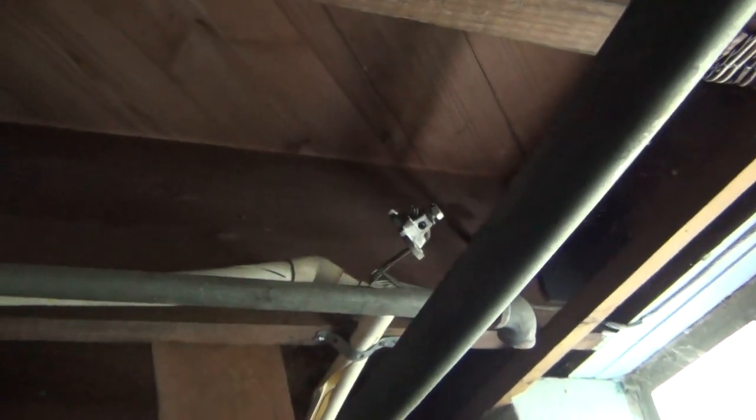In the basement, we'll clean up the floors — scrape any loose material, repaint the floors and walls in a neutral lighter color, similar to the tan or cream upstairs. The furnace is missing and needs to be replaced — a refurbished one is fine to keep costs down. Same with the hot water tank, which is also missing. There is an updated circuit breaker panel; a couple of minor things like tacking up the cold air return. Plumbing appears mostly intact, though there are a few spots to address — one visible cracked PVC pipe.